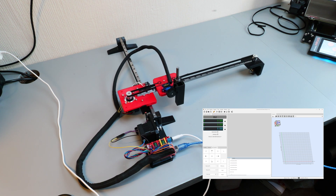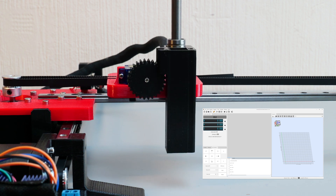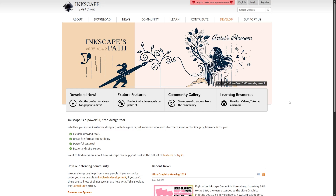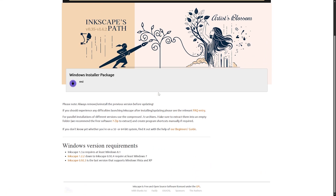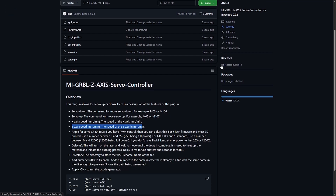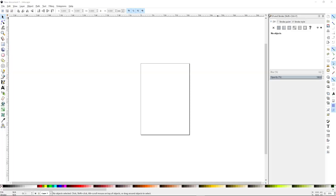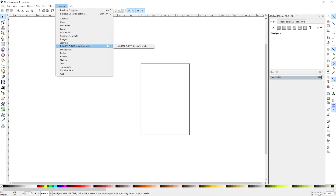I was even able to control the servo motor using G-code commands, which is really important because this servo is what will be moving the pen on and off the paper or whatever else it's drawing on. So we just need to get two more bits together and then we've got everything we need to start the drawing. The first thing is a software called Inkscape, which is what we will use to generate the G-code for whichever vector drawing you want to do, and in addition you're going to need to download this particular extension from this GitHub page. I'll leave a link below and then once you've got those two things we're ready to go.